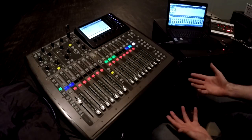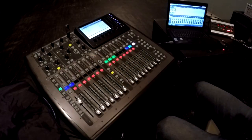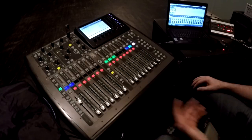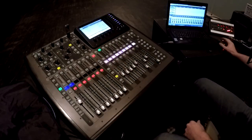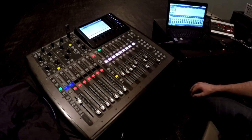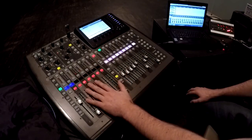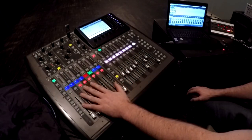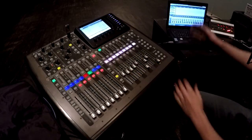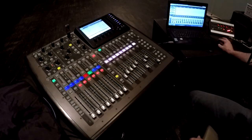Once we've done that we can actually see if the two devices talk to each other. So back on the board, we'll hit DAW Remote. DAW Remote comes up and you lose this section of the board — this channel strip of 1 through 8 becomes your DAW remote workstation. Channels 1 through 8 are listed here. Everything on the left side of the board becomes your channels you'd typically use during a live situation. The faders are 1 to 1: channels 1 through 8 are channels 1 through 8 in Reaper. If you move the fader on the console, the fader moves in Reaper, and vice versa.